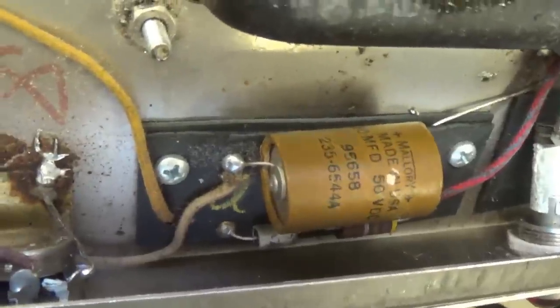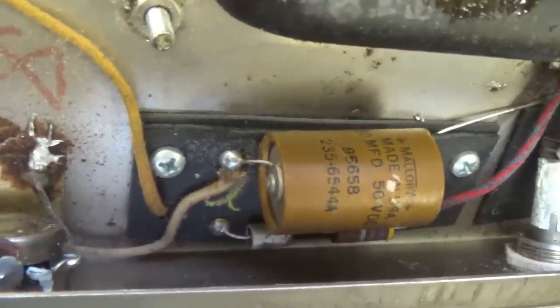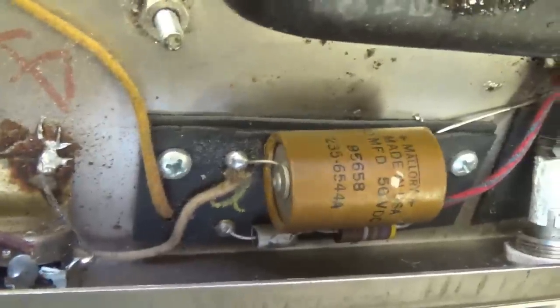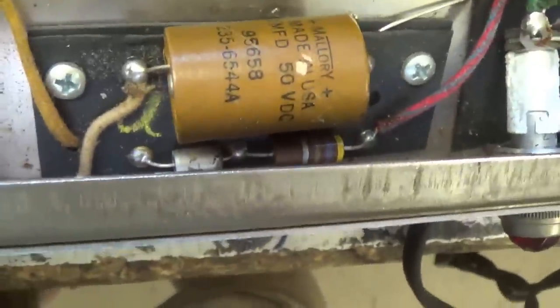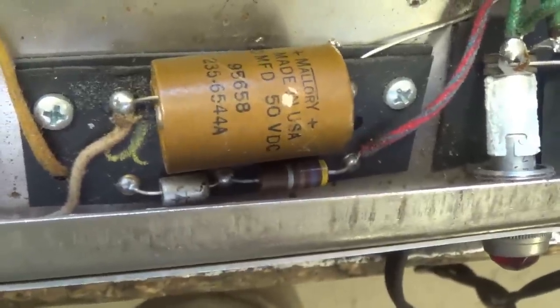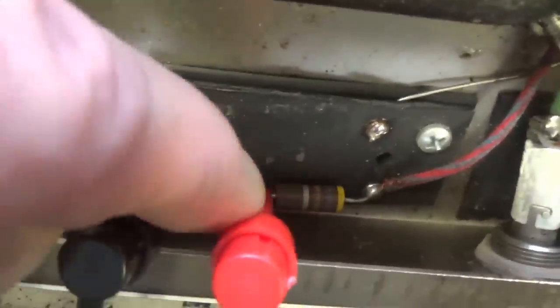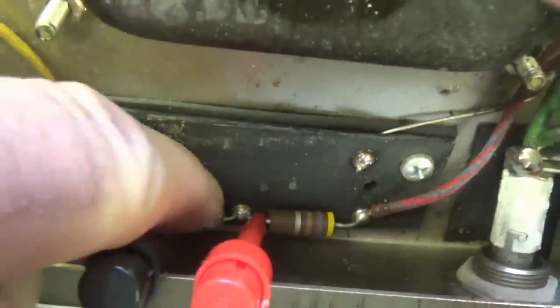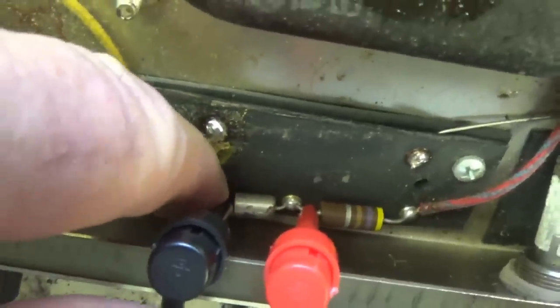Now let's replace that 50 microfarad at 50 volt negative DC bias supply filter cap. Check the diode, test it, and also test that resistor to make sure that they're both in good operating condition. And if you're wondering how to test diodes, put the positive or red probe on the striped end of the diode, the black negative lead to the unstriped end of the diode,